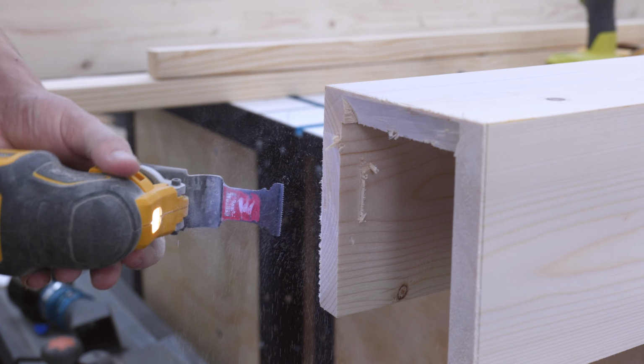I'm gonna go ahead and start on the kitchen side. This is the dining room. Kitchen is right here on the ceiling. I'm gonna cut in with a brush right where the ceiling meets the cabinets, just so I don't get the cabinets all messy. And then I will move over to this side with the roller.